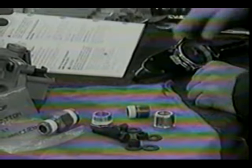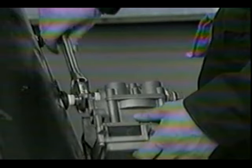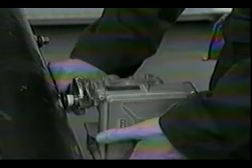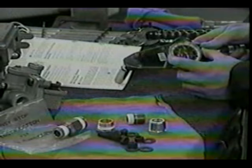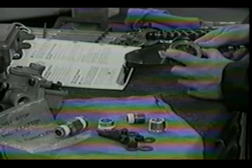Replace any damaged parts, such as bolts, nuts, or pipe nipples. For pipe nipple mounts, the pipe must have a 3/4-inch NPT Schedule 80 nipple. Tighten the assembly securely with the valve exhaust port facing downward. For bracket-mounted installations, tighten the bolts and nuts to 18 foot-pounds. After making all electrical connections, check electrical system integrity using the warning lamp procedure. Reconfigure the ECU if necessary. Following repairs, you should perform the ABS function inspection. This is the final test before putting the trailer back into service.